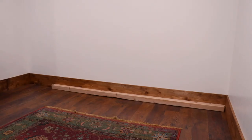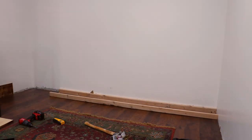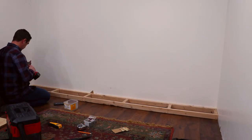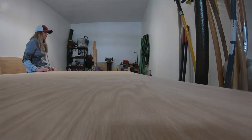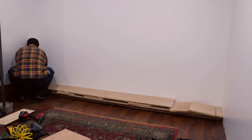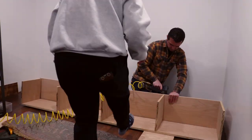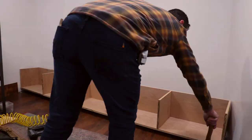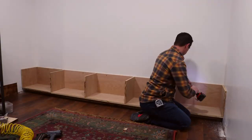I didn't want mine resting on the floor, so I took a different approach. I decided to build a couple of cubbies underneath the wall. To do this I needed a toe kick, so I got some two by threes. First thing we did was build a little base out of two by threes — I felt two by fours were a little too tall. We built the base and then began working on the cubbies themselves. To do the cubbies I got sanded plywood, cut it into sheets with a table saw to whatever sizes I needed. The whole thing is built out of sanded plywood and tacked together. It was a little tricky to get in — we had to pound it in because it fits perfectly, but we eventually got it and tacked it into the wall and also to the floor. I think it looks really professional and it gave me a little bit of extra room, and it also kept my rifles off the ground. I'm happy with it.